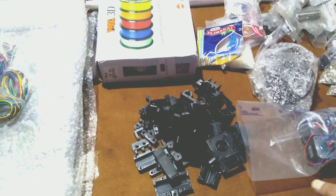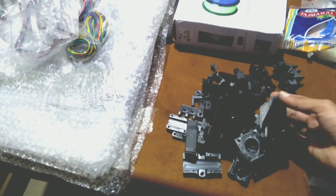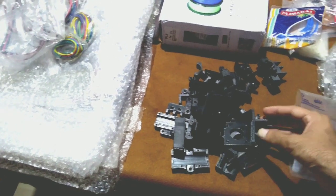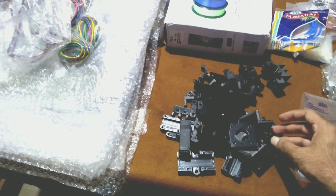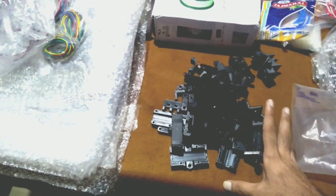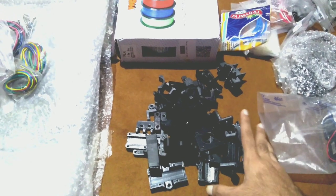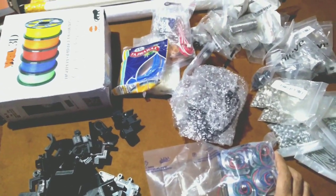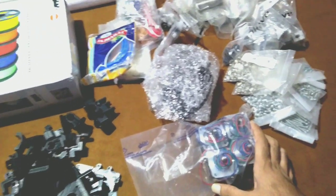Here are some parts which I purchased — some from online and some directly from the shop. For now we will just look at some parts. These are the 3D-printed mountings; I printed these using ABS material with 40% infill and 0.2mm layer thickness. I will use these mountings to mount the motor shafts, rods, bearings, and other parts. These are the NEMA 17 stepper motors for the X, Y, Z axes and extruder.